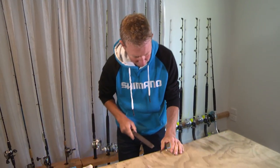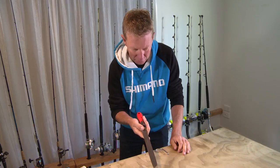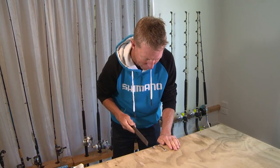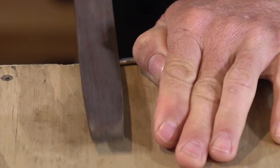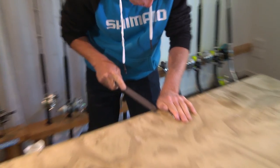The first thing I want to do is take the sides off to reduce the profile. I'm just using a standard bastard file which you get from any hardware store — get a good quality one, otherwise you're going to wear it out really fast on this stainless steel. I'm using flat, long strokes, coming right from the back of the hook and keeping my lines nice and straight.